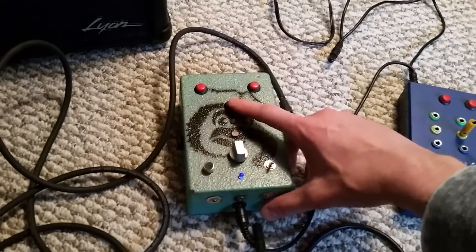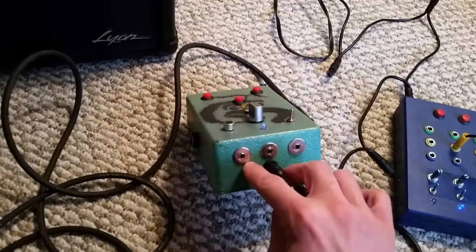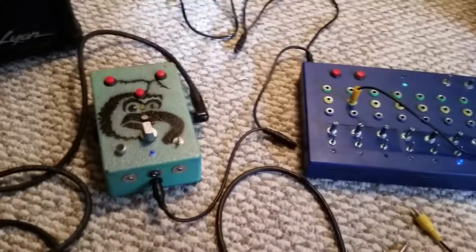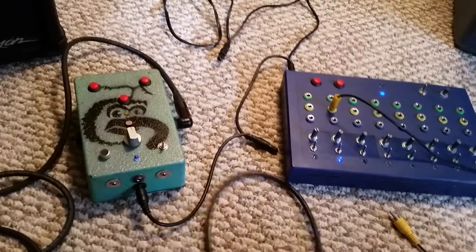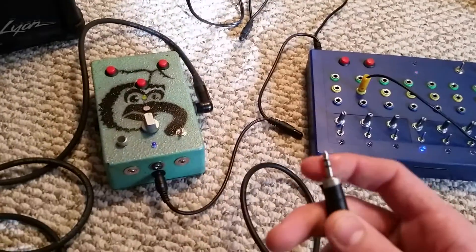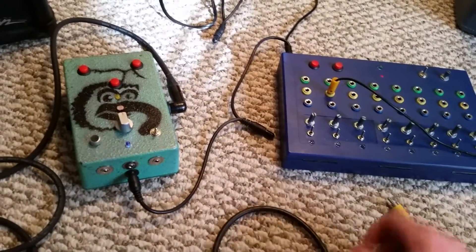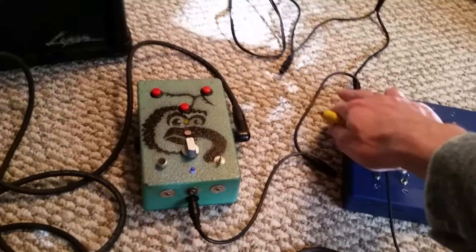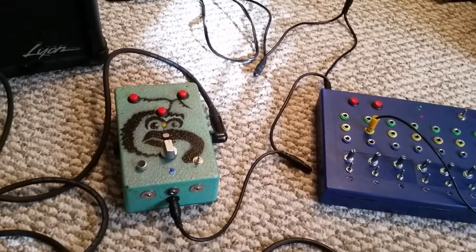This is your record button, reverse, and play buttons, and they're also triggered by these inputs here. You're going to want a voltage coming into your trigger points, but also you're going to want your negatives connected. So that's why there's a stereo jack here. The negative is connected by the daisy chain here. That's why you only needed the tip to trigger the loop function.